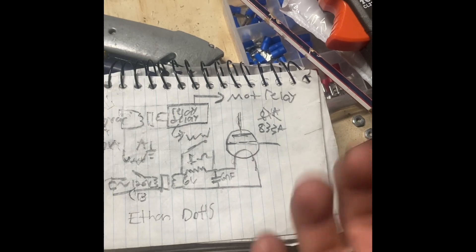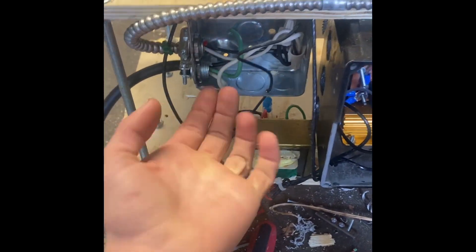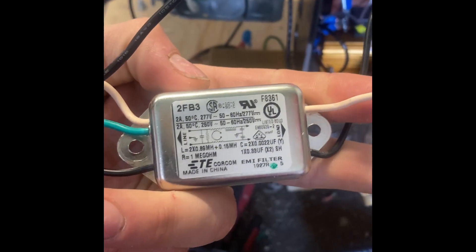The reason it says 6-volt and 811A right there is because I was originally going to use the 811A. Here's the physical build: power comes out of this variac going into this box. The reason there's a box there is it's coming out of a line filter — similar to this one, except instead of being rated for 277 volts at 2 amps, I want one rated for 120 volts at 20 amps.